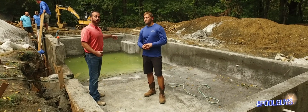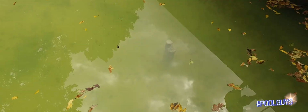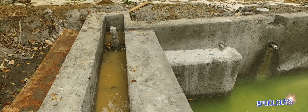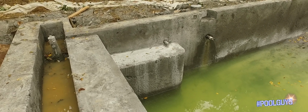Before, when we talked about when I was up here, just the rebar in the ground itself, you could see the main drains and the hydrostatic valve. Currently, the hydrostat's underwater. That's a good thing, the concrete's staying wet. We're pumping out from around the pool, and the hydrostat's doing such a good job that while we pump from the outside of the pool, it actually drains the water from the pool. So it's operating exactly how it's supposed to be.